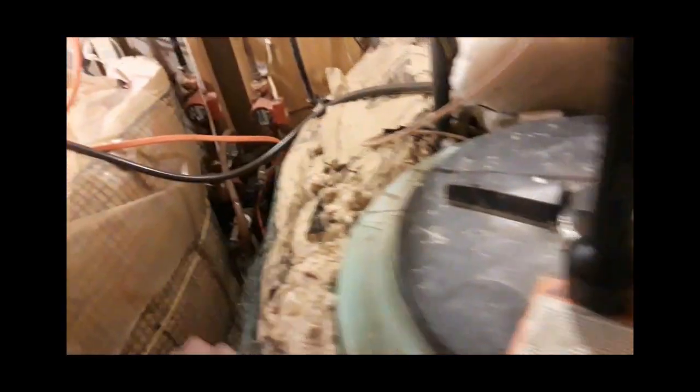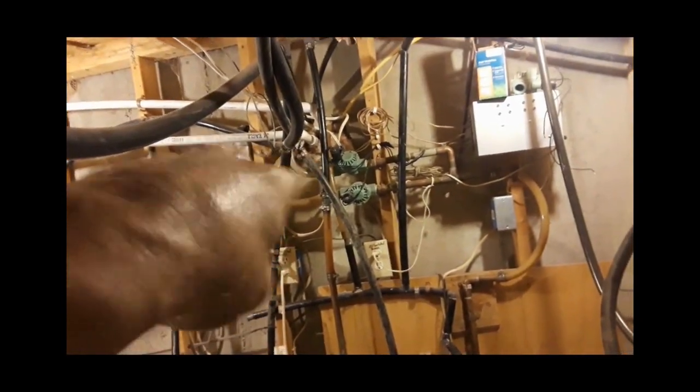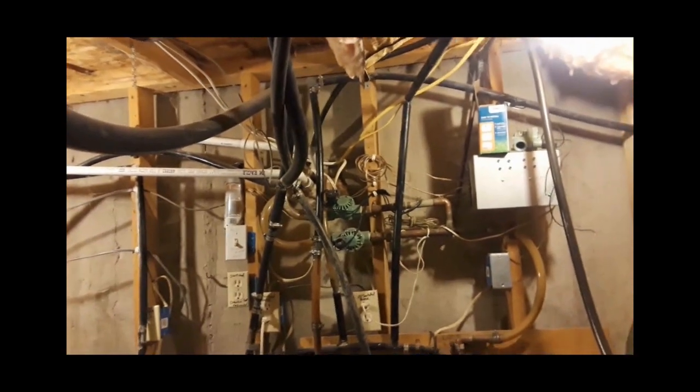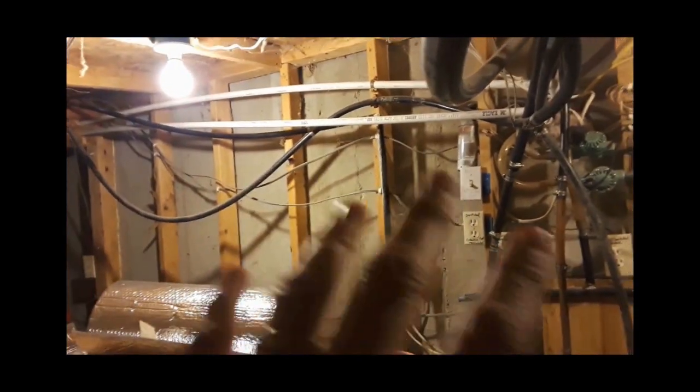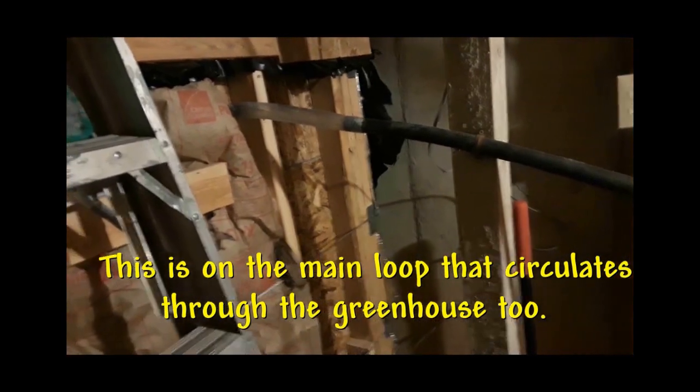So let's go around here and look at the others. Now this is one tank, and then there's another tank here. These are 500 gallons apiece, so that's a thousand gallons there, and there's the pumping apparatus back there. And then back there, that little hole in the wall with the pipes going through it — some of that goes into the radiant heating system inside the house. Right there is a concrete foundation wall of the house, so this is a lean-to built onto the house. Now, this is that new tank that I built — a 1,100 or 1,000 gallon tank. I've trimmed off a lot of that excess plastic. This is the overflow from it, and I just measured the flow rate: this water is flowing through here at roughly 110 to 120 gallons an hour.